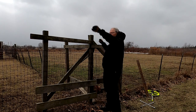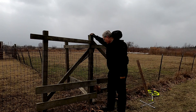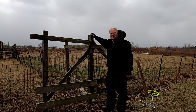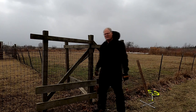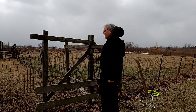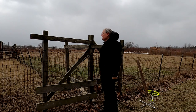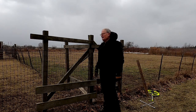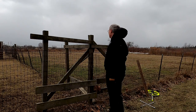It's secure. If I just put one post in the corner and stretched it on the other one, I felt like over time the pressure might warp the post, or break it or something. So I put in the corner like three posts, 3 4x4s stuck in the ground. I dug all these by hand with a shovel. I didn't count how many I have here, but again, these have been in the ground since 2006. So I did all of them then.